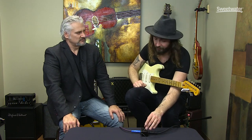That's very cool. Yeah. And most of the Tone Print pedals, or actually all the Tone Print pedals, have a built-in buffer. And the BonaFide Buffer is based on that circuit, but it's a vastly improved one. Right, but just to be totally clear, no pun intended, the buffer on those is only active when the pedal is active. Otherwise, they're true bypass. They're true bypass, but there's a little dip switch inside them that allows you to select whether they're buffered or true bypass. So you can put it either way, right?